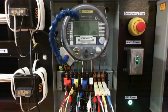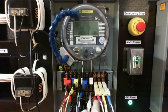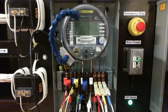Okay, so what I'm doing now is I'm driving the current with my duckbills. Remember, for our duckbills, it's in the white, out the black. So it's out the black and in the white. So I'm going to be driving the current out at the bottom here on the black side of those duckbills. Okay? So what I'm going to do is leave these connections. I left them there so it'd be a little bit easier, with less of a chance of breaking anything.